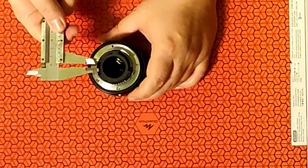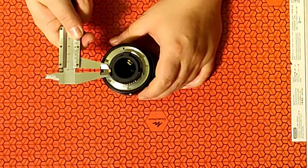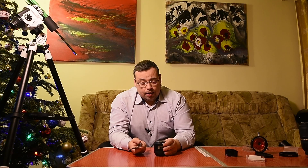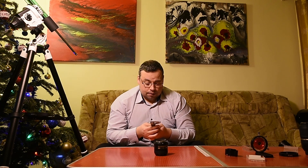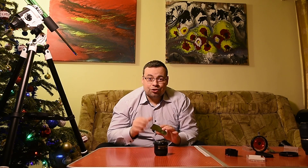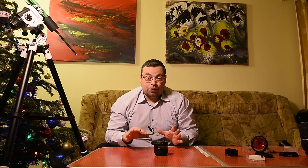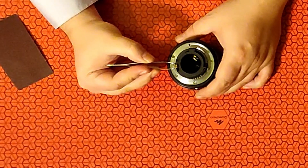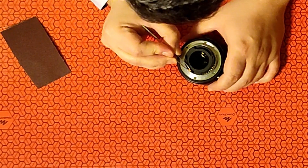You can use a measurement tool like this one — it's called in Romania 'Schubler,' and in English it's called Calipers. You can use it to measure the distance needed from the small mechanism inside the lens to hold the aperture open. I measured it — it was about 4mm. I cut it from a wood stick; it was 4mm but a little bit too much, so I used sandpaper to make it just a little bit smaller, about 3.9mm. This was enough to hold the aperture of the lens wide open. If you want to remove it, you can use tweezers to grab it and remove it.